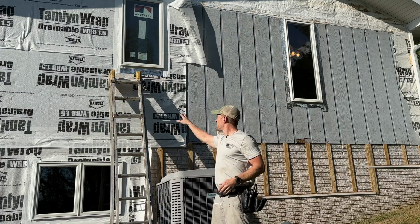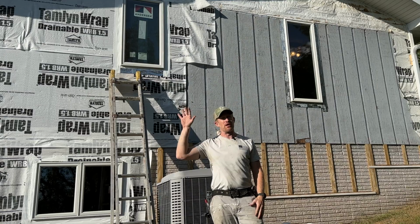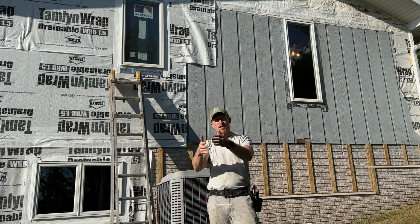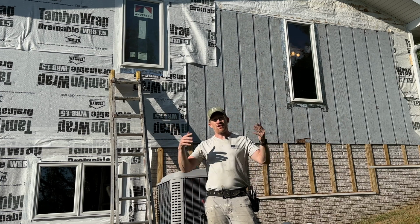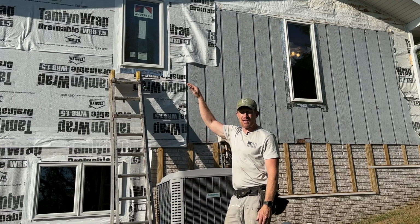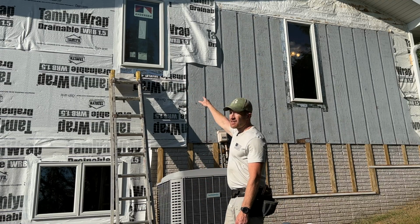And what that does, we don't ever tape the bottom, but what that does is it gives a layered effect between your house wrap, which is over top of your tape, which is on top of the flange, and then the top tape that's overlapping your side tape. All that's done is just so that you have kind of a shingled or layered effect so that if any water does get in at the top, it can work its way out instead of being trapped in. Especially the case on the bottom.